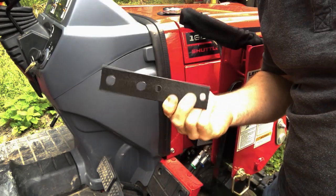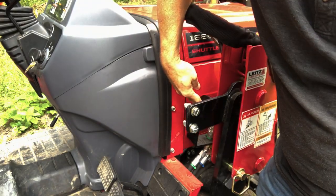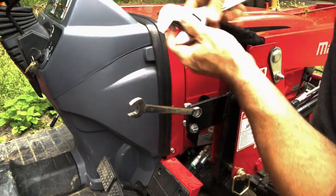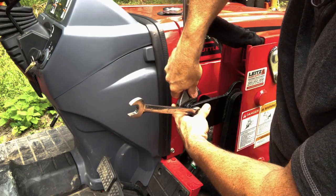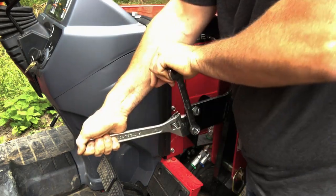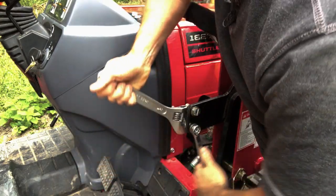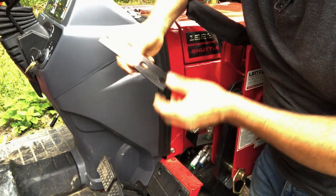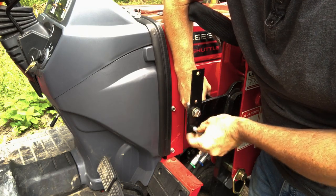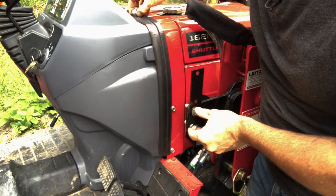The first step in this installation is to install the mounting bracket. That's going to go right here on these bolts that hold up the quick coupler area. You need a three-quarter inch wrench and a backer wrench or socket, and we are going to loosen these up. With those nuts off, I can now take this bracket and take the bolts out one at a time so nothing drops off. That bracket is going to mount here on the outside, and I'm ready to put the lock washers and bolts back on.